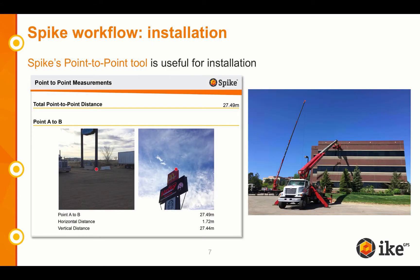How many times have you taken a 20-foot boom truck to a 40-foot truck job, or you didn't adequately measure your available working space and now can't get close enough to the install site? With Spike's point-to-point feature, you can quickly get the linear distance between two points just by taking two photos. First we pointed the Spike laser to the ground and took a photo, then we rotated to the top of the sign and snapped a second photo and quickly got the height of that sign. You can use point-to-point for measuring the height of a bucket truck or a ladder, setbacks, ground clearance, or the height of a sign.